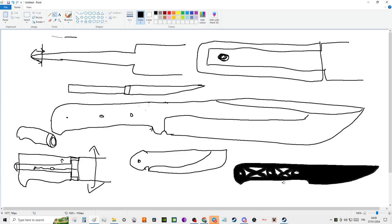And this would be a better option than just having these sections emptied out, because whether it's in construction or wherever it is, if it's a desk or a heavy duty desk, you don't just have the two legs like this. You always, like on a shelf, have struts. You have these components that prevent the whole thing from bending and shaking. It increases an enormous amount of strength. These bars here probably don't even have to be that thick or that large. They can probably be quite thin and quite small and still add a substantial amount of strength to your design.